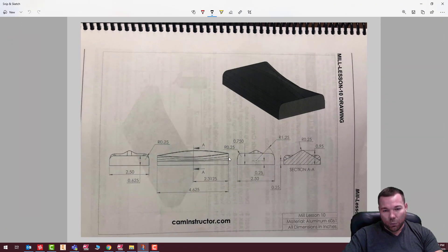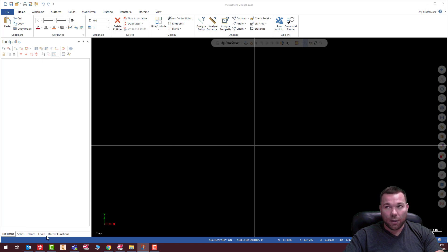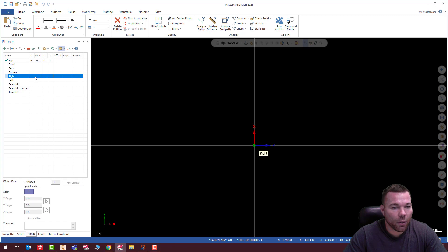The first thing I'm going to do is start out with this one, because this is the right side view. The right side view is going to be at zero on the right side. It looks like there's a very large radius in this corner. I'm going to start with creating that circle, which takes both of these radii, and then we have a straight line going across it, and another radius blending tangent to it. Let's go ahead and create that. I'm going to start with my planes — let's change that to my right side plane. I'm going to view it as my right side and work on it as my right side.